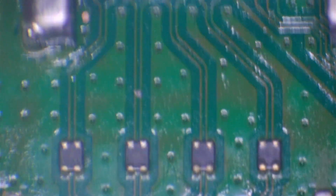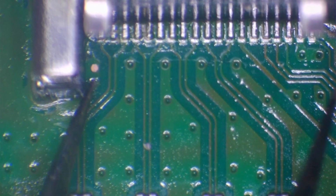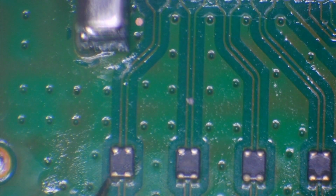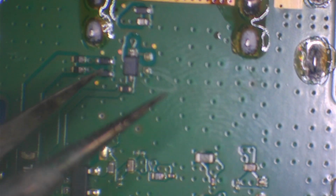So what we'll do is some tests on the pin here, so pin one, for continuity to the filter. And then I'm going to test the filters themselves. And then I'm going to test a few of these diodes and things around here. So like this diode here, there's some on the back. We can test this chip here by testing some of the capacitors, but other than that, they don't generally show up as bad. So we can also test some stuff here on the back. There's a few things here that we can check, such as these diodes just here, this one here, this fuse here. So this is the resettable fuse I was talking about.